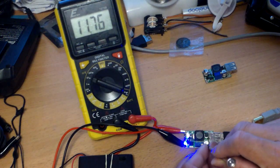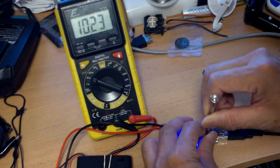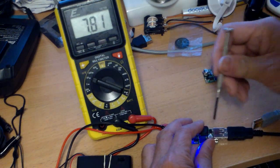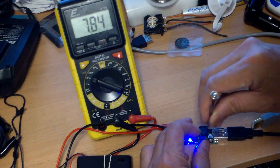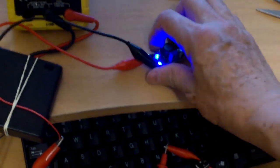You can make the adjustment here and look at the meter — I'm turning it clockwise and it goes down. Nominally you should set your voltage for the USB to be about 5 to 5.2 volts. I have to be careful here — I don't want to short it out.